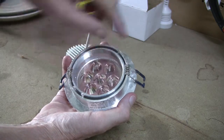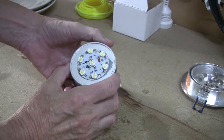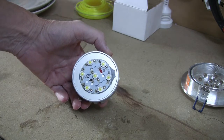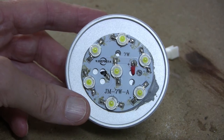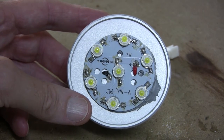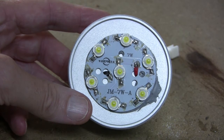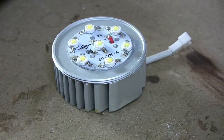All that's left here is the diffuser for each diode, so we put that piece to one side and have a look to see if we can actually see anything before we start. I've had a little look at this and certainly on first viewing I can't see any faulty diodes, so the next stage is to get the test meter out and probe about.